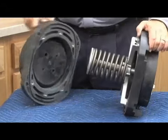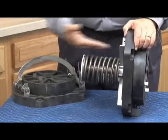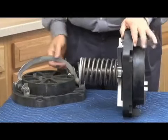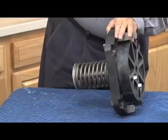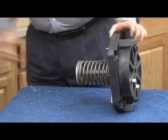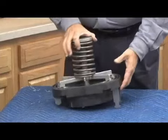inside the assembly. So this is the first check. Water's flowing this way, so this is in line. Number 1 gate valve would be here. So water flows into it. Second check would be sitting inside the body, similar to that. So we've done the second check. Now let's do the first check.